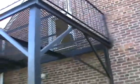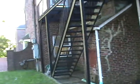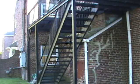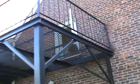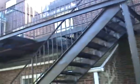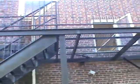This fire escape is definitely going to need oversight, 3 to 5 visits. This one can be done with 3 visits, so there's going to be a requirement that whoever the engineer of record is on this, he must be here at the initial start of any repairs, in the middle to confirm repairs are being done, and then as a final. Otherwise, you can't just come in at the end when all work is done. It has to have engineer oversight in order to be considered a certified repair as per the inspection criteria guidelines submitted to the fire official in lieu of a load test.